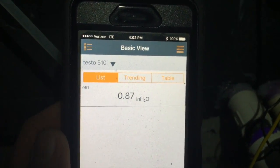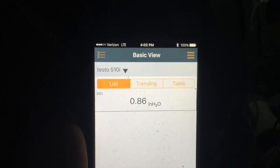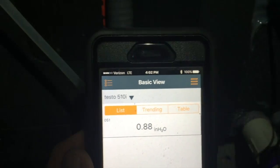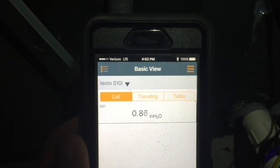After seeing that blower relay jumping around, I thought that might be why my fuse blew, but it hasn't jumped anymore, and so I'm trying to see if I can find another place where a high amp draw would take out the fuse.